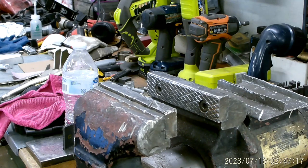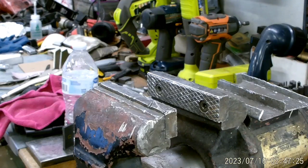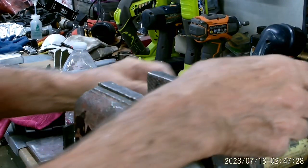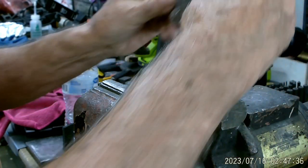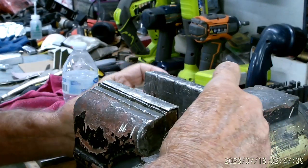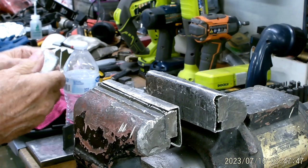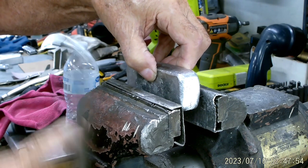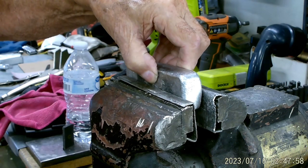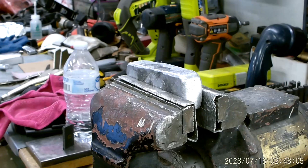I've been looking for a way to polish these aluminum bars when they're done. This one is really coarse all around — it's got some lumps and bumps and I want to sand it down and maybe do a little polish work on it. But if you put it in this vise, you can see these jaws have teeth on them and they will leave marks in the aluminum. So what I've finally come up with is I made these guards that cover the teeth. So if we want to do an edge, we can still hold it here — crank it down in there. That'll work just perfect.